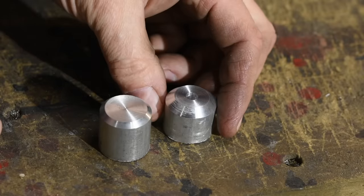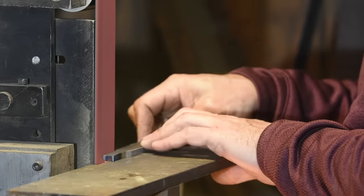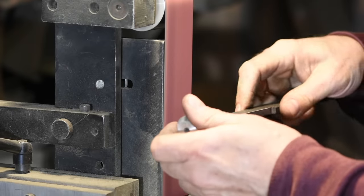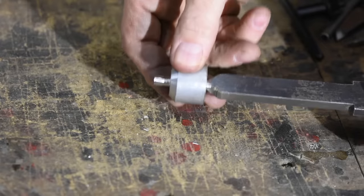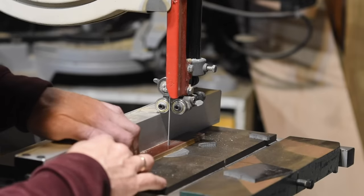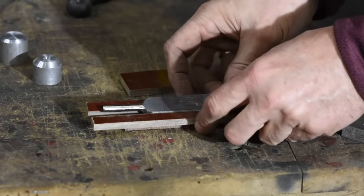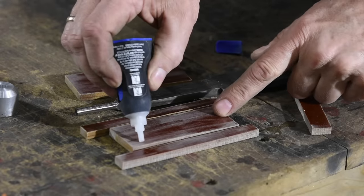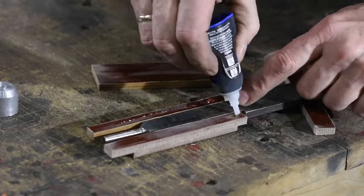In this particular case, I'm going to cap the handle with a pommel, which will be peened into place. To make that work, I'll grind a thin cylinder at the end of the tang, which will fit through the hole in this aluminum pommel that I've fabricated. Once it can be pressed fit onto the handle, I'll make a sandwich handle — this would most typically be wood, though in this case I'm taking a shortcut and using micarta again. I'm using super glue here, but in real life I'd actually use epoxy.